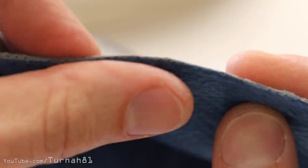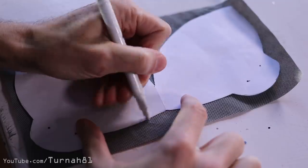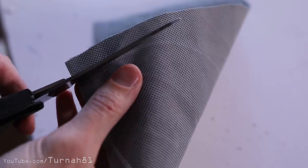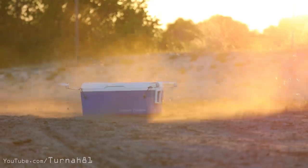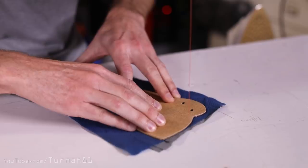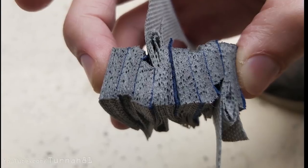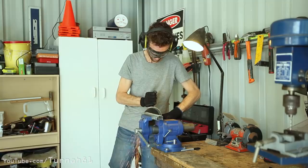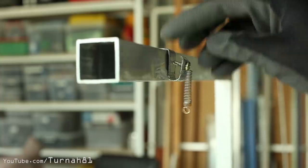I'm going for a lighter layer against your face, which is more comfortable and probably provides a better seal. If you're just making one mask, you can use the template to trace it onto each layer and cut them out with scissors. I was trying to work out a way to cut more masks at a time, and it turns out a hot wire foam cutter does an absolutely amazing job at cutting this stuff. I pretty much got to the limit of how many layers I could stack. If you're cutting lots of masks, it's definitely worth making one — it costs about $30 in parts, plus an old car battery and table, and about 30 minutes to put together.